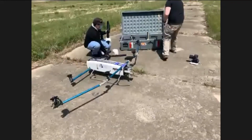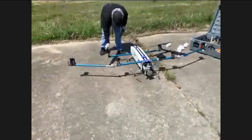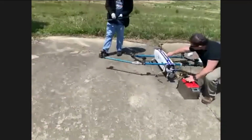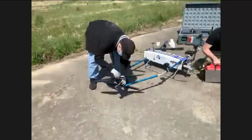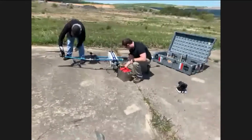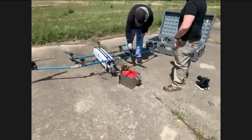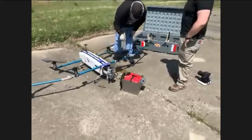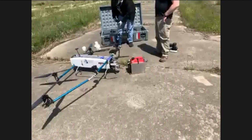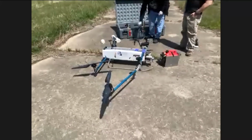When we at Advanced Aircraft Company say hybrid, oftentimes in the drone space, when people talk about a hybrid drone, they're referring to a quadcopter and a fixed wing having a baby, like a hybrid configuration where it's part airplane and part quadcopter. This vehicle, when we say hybrid, we're referring to hybrid propulsion, like a hybrid car. So a gas engine turning an electrical generator, producing electricity, is pushing electrical power onto the 48-volt DC bus of the aircraft. And then there are smaller lithium polymer battery packs on that DC bus. Power is drawn off that electrical bus to spin the 6 motors and 6 propellers.